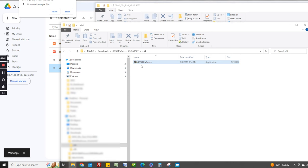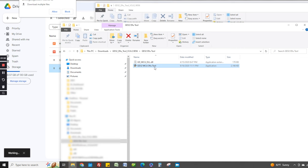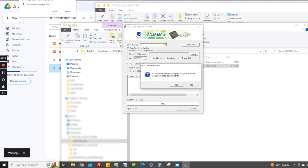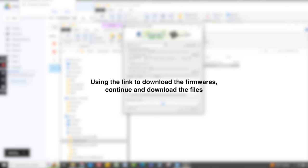This will install the driver needed. After you do that, go back to the other folder you unzipped, which is the DFU tool. Double-click on it and open the file. Once it opens you'll get a prompt asking if you want to update your product — say No — and then select Verify After Download.